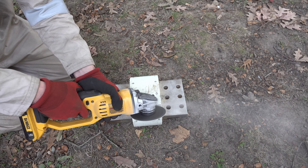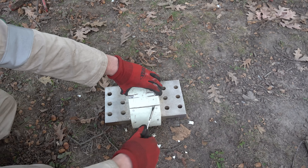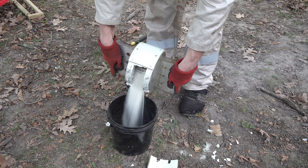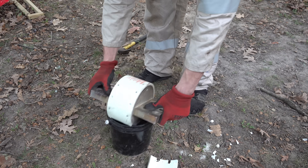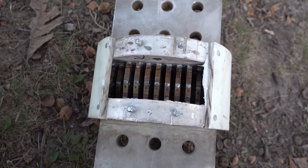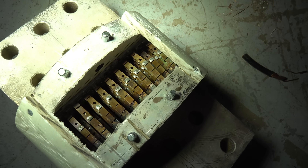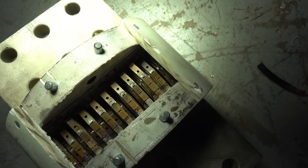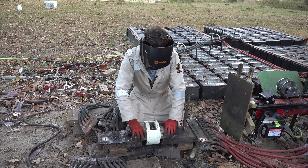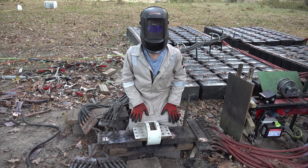In the interest of making more sparks, I opened it up and emptied out all the sand inside. This does change its fusing characteristics, but due to the nature of the continuous extreme DC currents I'll be feeding it, the fuse will now take an even higher impulse before breaking the circuit — because without the sand, it's going to make some angry plasma. That's hilarious: it's just a bunch of smaller fuses in parallel. Fuselets all the way down. I'm not even going to bother cleaning the contacts because it'll melt straight through all that char on there.